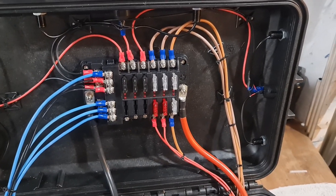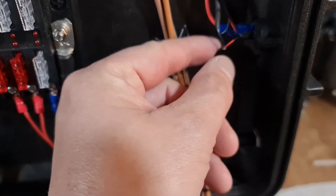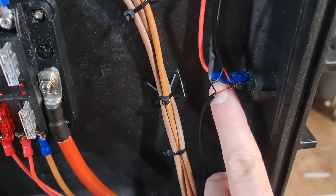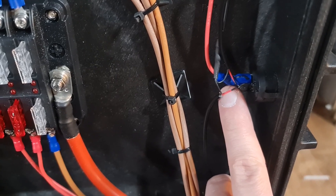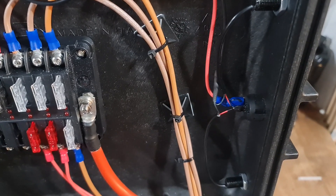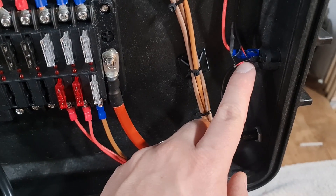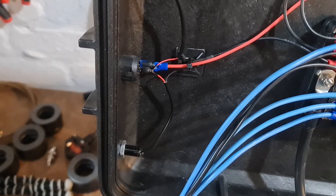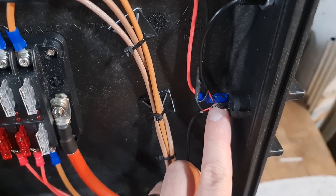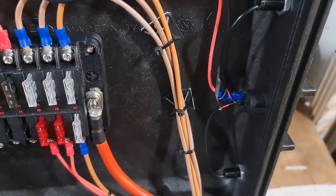What don't I like about this — the downsides? Well, you see these LEDs in here? I really like these, but these wires are incredibly thin. That's the PVC — look how thin that is. And when you take that sheath off, there is hardly any copper — just two or three tiny copper strands, and it's too small to actually put onto a crimp connector. So what I actually did was join the wires together and solder them direct to the terminal of the switch, and I did that on all three. With doing that I needed to insulate them somehow. This black stuff you can see on here is actually liquid electrical tape — fantastic stuff — and that's basically got me covered for shorts.